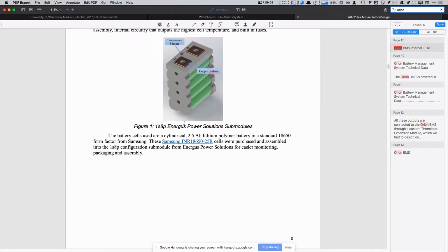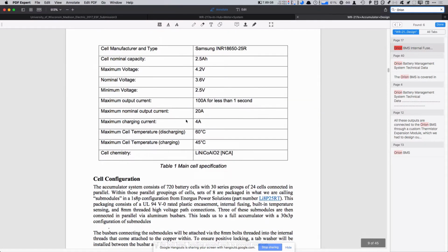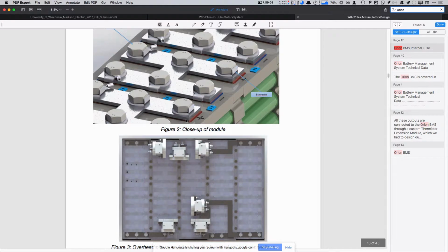But I think you're on a good start. I think the next step is definitely to understand what kind of current you want to pull, based on what you want the motor to do and what torque you want to output. And then get some things down and look at schematics. If you want to have a date to review the schematics, I can try to get my group friend and we can sit down and review them, because he would know if you were breaking rules or not. Sure. Which would be a huge head start before you started purchasing components.